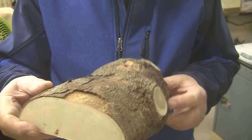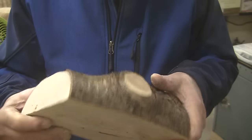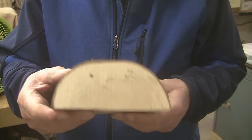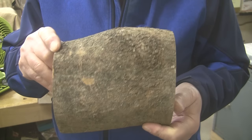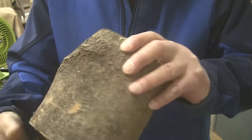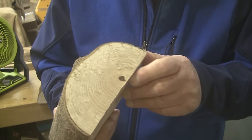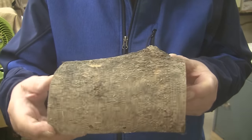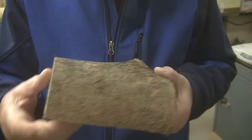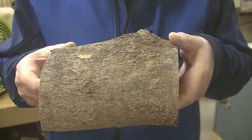This one — you can see the bark is probably not gonna stay with us, so I'm gonna turn that side up and just turn that bark away. The other one, the bark is much tighter, not super tight, but much tighter and I think it will stick with us. Since last week I did one with no bark, a round bowl, I'm gonna turn this one today and try to keep the bark on. I see a little bit of spalting in there. I don't know if it's gonna be round or if the ends are gonna be square or semi-square. I'm gonna find the middle, drill a hole for a woodworm screw, get this mounted up on the lathe, and we'll get to turning this Madrona from Rick Chapman.